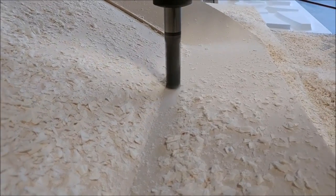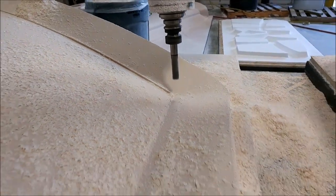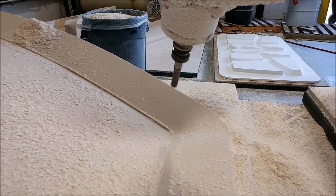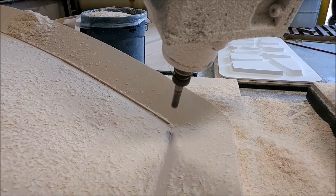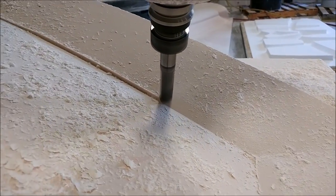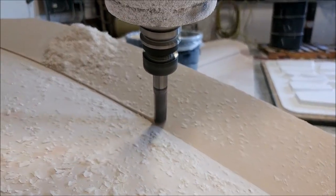Next up on the machine, running the swarf cuts around the edges for the transition from the field to the flange. As you can see, it's doing a nice job cleaning up that transition. Here's the next pass running up the backside. It used to be that when I ran these they would gouge a little bit due to slop in the Z-axis, but now as you can see there's no extra gouge — it's just taking out that little bit of putty between the two different faces.